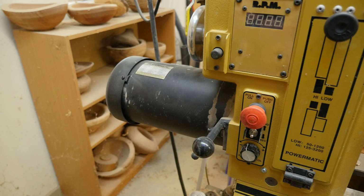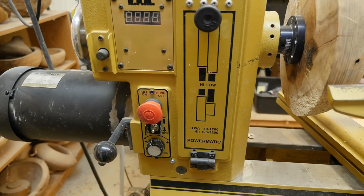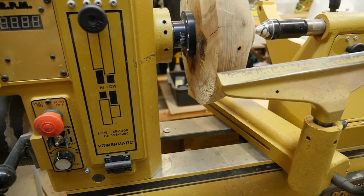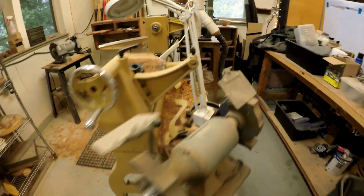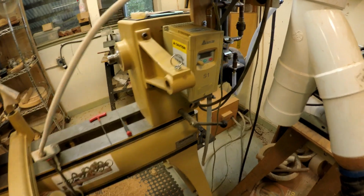It was getting power because the numbers in the digital tachometer were on, although they stayed stubbornly on zero. The motor itself was an unlikely suspect. When motors die, it's usually with a lot of smoke and fire and screaming. Now, a lathe is a dead simple tool with nothing but a motor spinning a chuck, and the only complicated thing on it was the electronic speed control, and it was pretty obvious that mine had failed. So I started poking around on the lathe to see if there was any way to fix it.